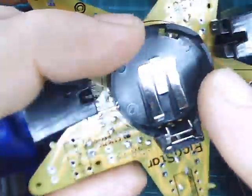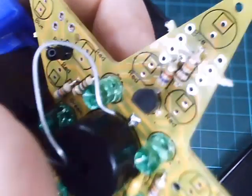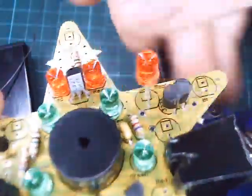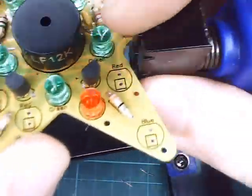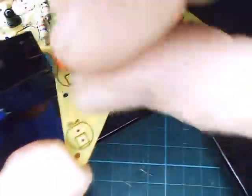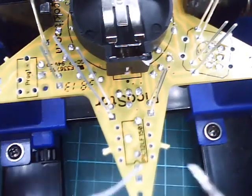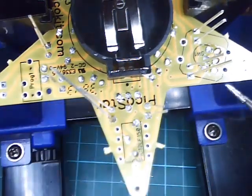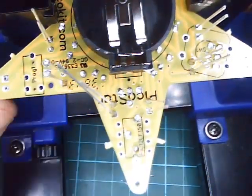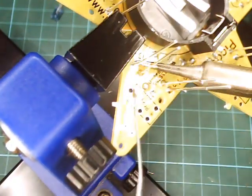It's time to put in the battery holder — you might need someone to hold this in place for you. Try not to burn any of the other components on the PCB. Now it's time to fit the red LEDs. I'm soldering these with a bit of pressure underneath so that they seat correctly. Apply solder to one pad, then quickly while the heat is still there push a finger underneath the LED and remove the soldering iron so it sets in place before soldering the second lead.